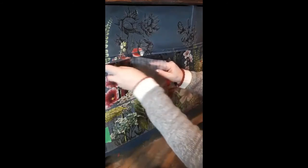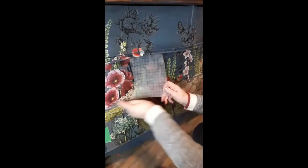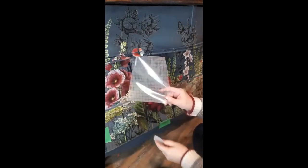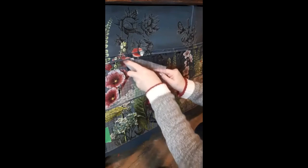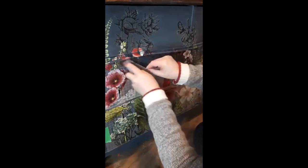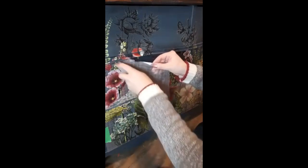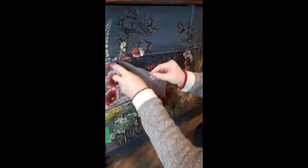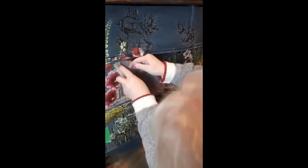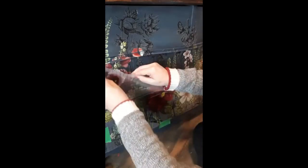But yeah, when I post the pictures of the before and after, you'll see what I mean about the drawers. I don't know how many hours I ended up sanding everything, but it was a long time. And just to get the worst of everything off of this piece, it was bad. The top took 5 go-rounds of paint stripper to get the top stripped down to wood. So that was a little bit unexpected. Usually I do 2 rounds of paint stripper to get a top stripped off, but this one actually took 5, so that'll give you an idea of all the gunk that was on it.